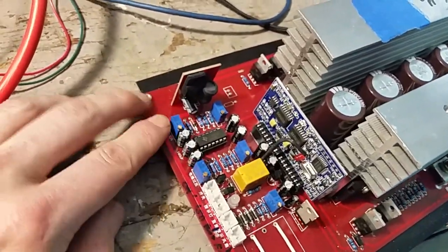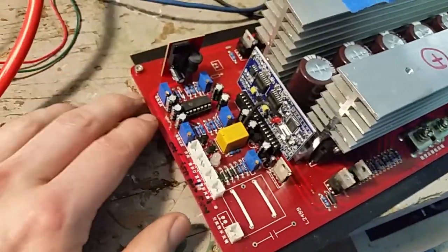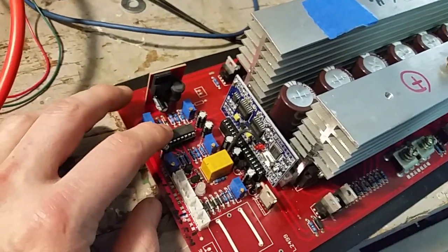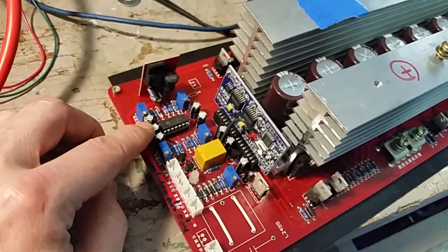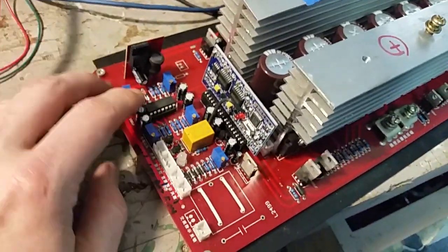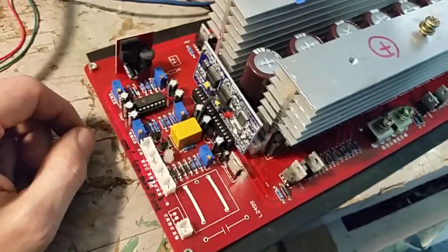These other two are the low-voltage cutoff and the high-voltage cutoff, and that's why I wanted this inverter to work in the first place — lithium-ion batteries have a different voltage range from lead-acid batteries, and you can dial that in with this. It's very hard to find an inverter on the market that will work with lithium-ion batteries, is freely programmable, and doesn't cost as much as a car.